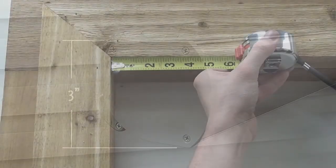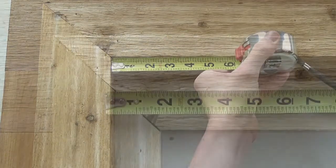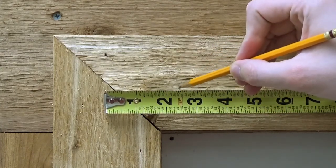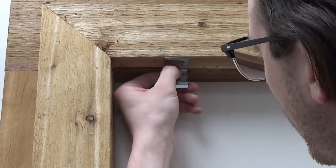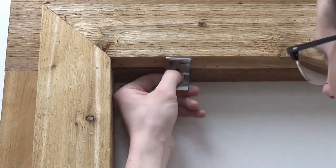To install the shade, measure and mark 2.5 inches in from the edge of the frame for inside mount, and 2.5 inches from the edge of where the cassette will be for outside mount. If more than 2 installation brackets came with your order, space additional brackets on studs evenly between the 2 end brackets and mark their location. Mark the location of the screw holes using the brackets on the previously made marks.